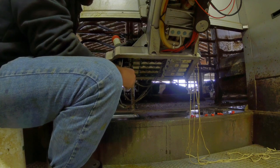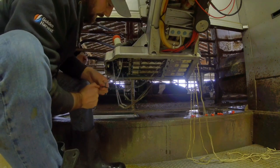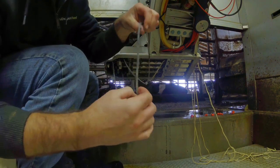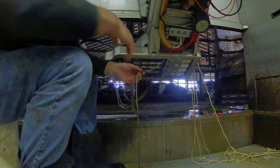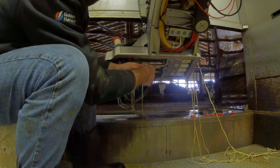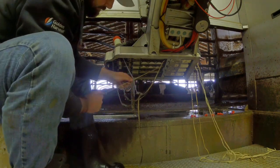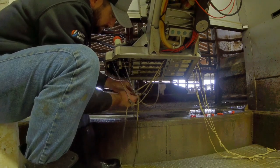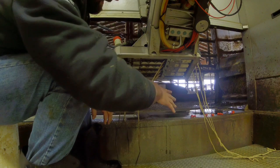It's always fun working with a really soggy rope. See if I can get this pulled through here — I'll show you what I'm talking about. This rope's getting kind of thin through here; it runs on a little cylinder so it gets worn out. Every time I change these chains I don't necessarily redo the ropes — the ropes last just a little bit longer than the chains, so it's about every other chain change that I'll do these ropes. I've got the ropes all tied now.